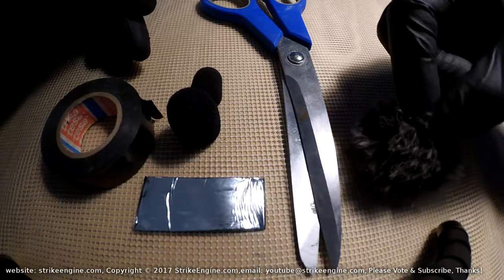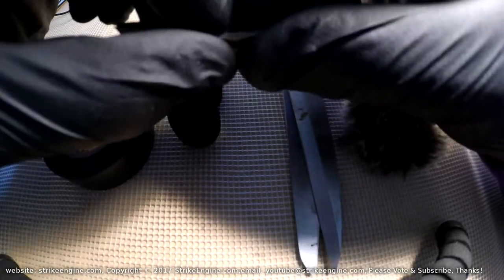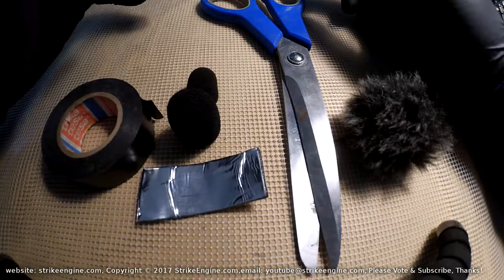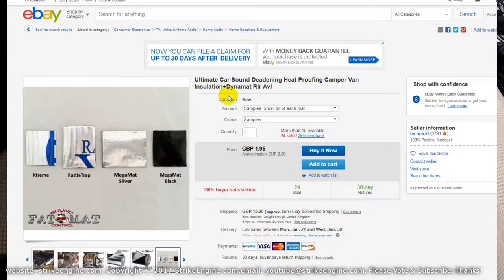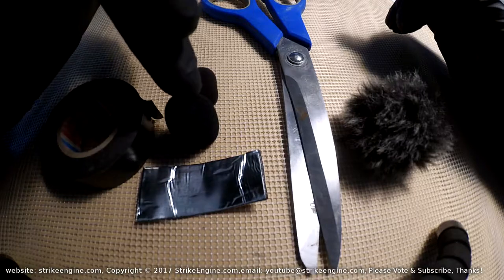To upgrade the microphone we're going to need scissors and sound deadening. About the sound deadening — this is tar-based or butyl-based sound deadening. It is not closed-cell foam sound deadening; I don't believe that will do anything. You need something similar to Dynamat or Boom Mat from DEI. On eBay there's a company that sells samples, and because we're only treating a small area, a sample should be sufficient. Not foam sound insulation — that won't work and the mic will end up too big.